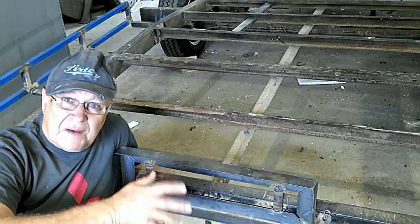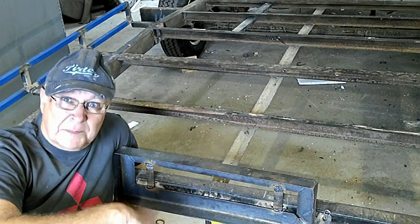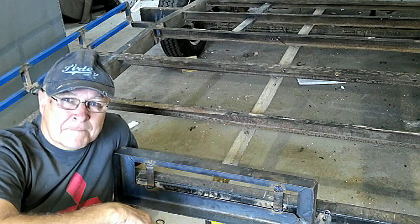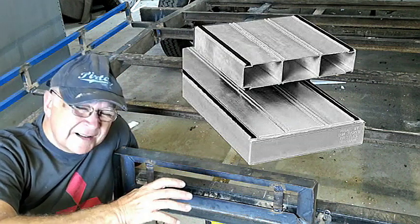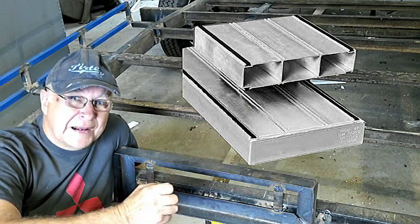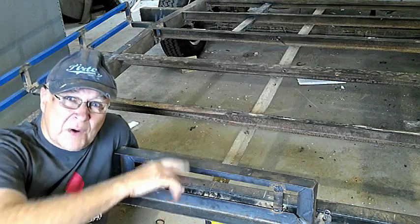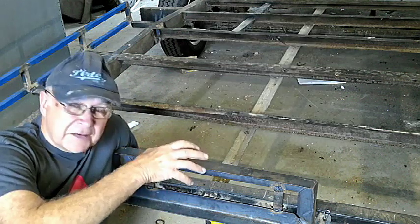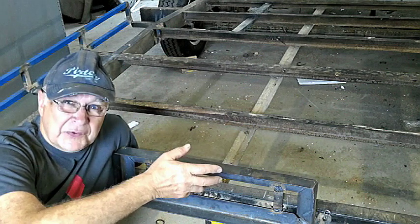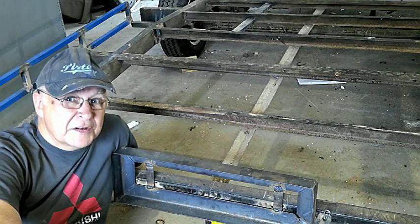But scaffolding and building planks made from aluminium are a fairly common choice amongst car club enthusiasts for trailer floors. It's cheap, it's light. The main disadvantage I find is those planks tend to be fairly narrow. So if you're only using one plank, you tend to make the trailer planks the width of your car, and then when you go to put something else on it, the danger is the wheelbase is different and it doesn't fit. But it's certainly a good material.